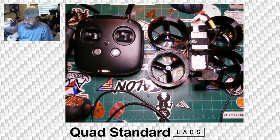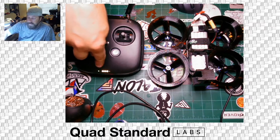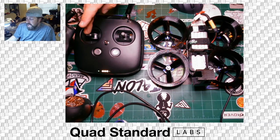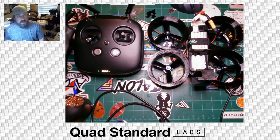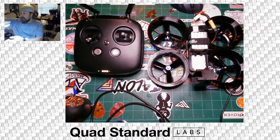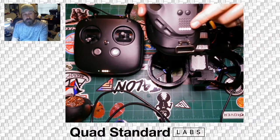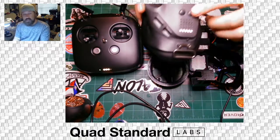You'll see the green light come on. You may still hear beeping — that's now because the throttle is up, so turn that down. Once that's resolved, you can arm the quad. On the goggles themselves, on the side, it shows the channel number. It's in channel one mode right now, and you can change the channel quickly from there.